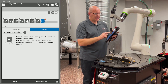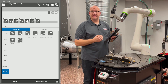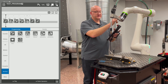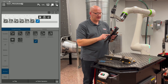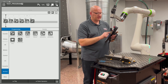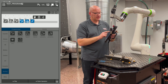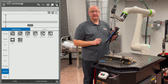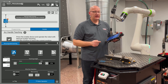Once finished, minimize the robot operation tab, hit Complete, and acknowledge that handle teaching is completed — it removes the icon from the timeline. That demo showed how to record points using the smart torch. To delete this program, you can drag individual points out of the timeline, or hold for three seconds to highlight multiple points, select a range, and hit the trash can to delete them.